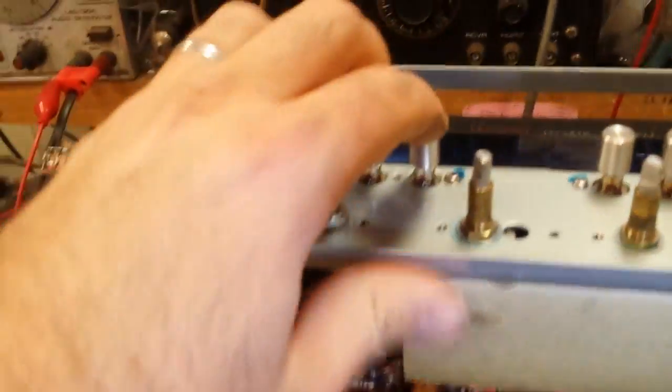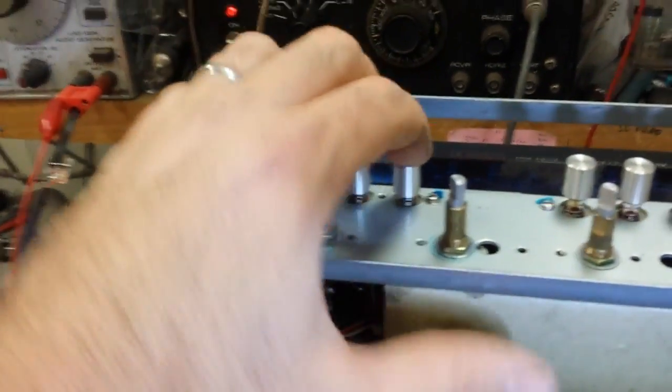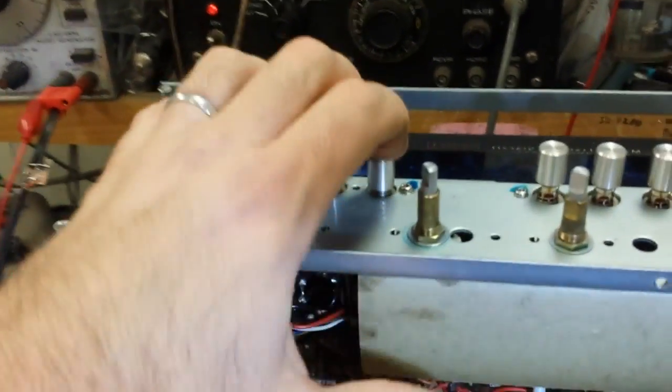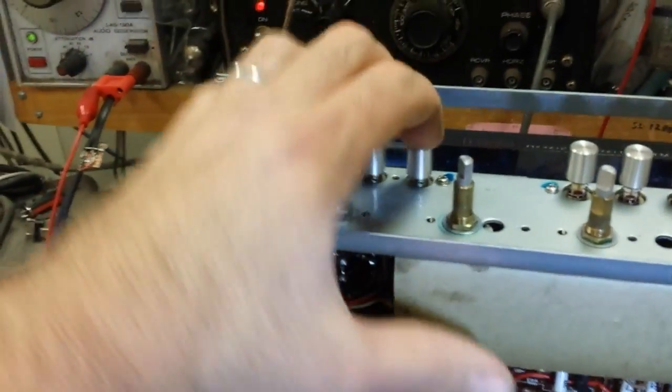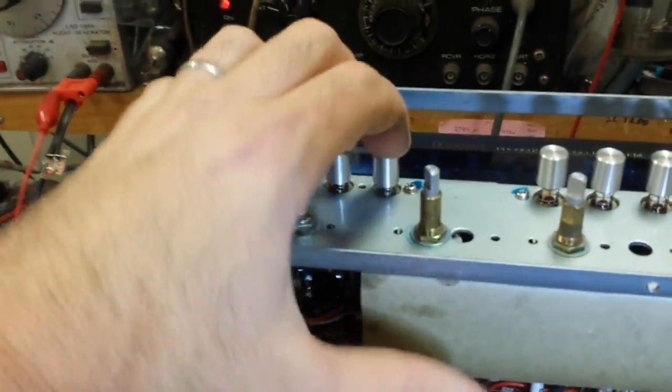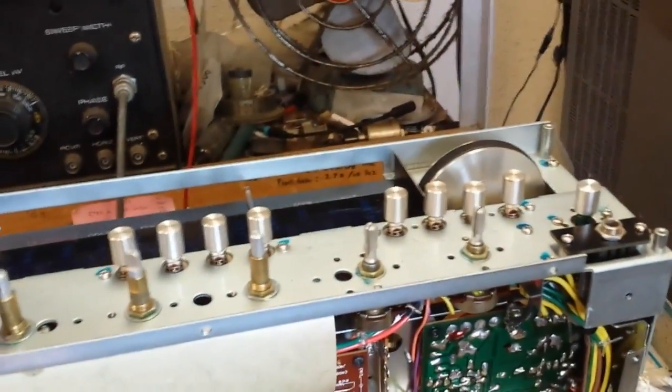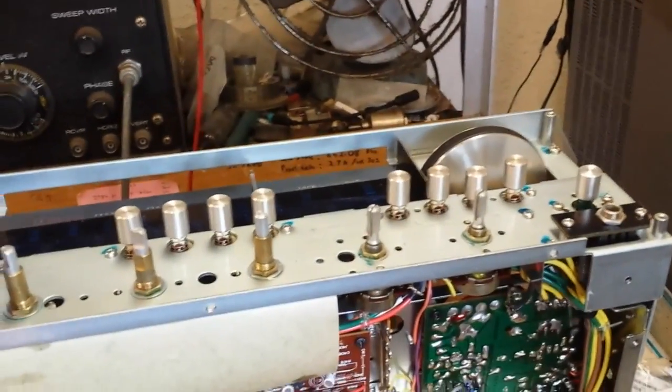You can talk to Duo Joe, which is the lamp guy from Marantz — I think he has power switches. And if not, Hollywood Beverly Electronics sells a switch that works very well for these, at least most of them that don't have the giant button shaft on them. So I'm just working these switches and we're going to do the other banks, and then I'll show you how to burnish the relay on these things, and then we'll get to the protection circuit.